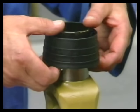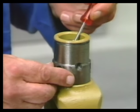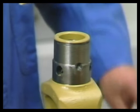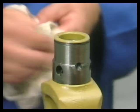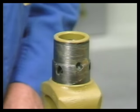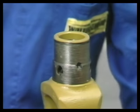To remove the QS lock from the slip-on yoke, it is necessary to remove the retaining ring, to lift off the locking unit, and to remove the securing balls. To fit the QS lock, the lock guide assembly must be cleaned and greased. Insert securing balls.